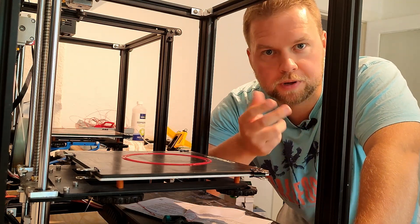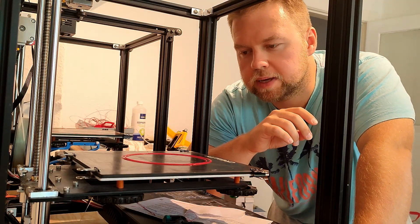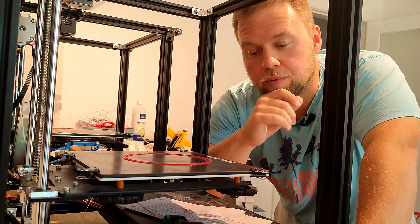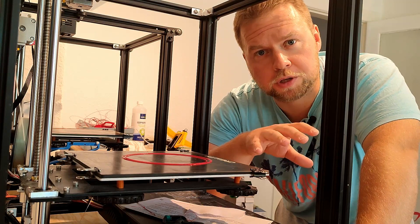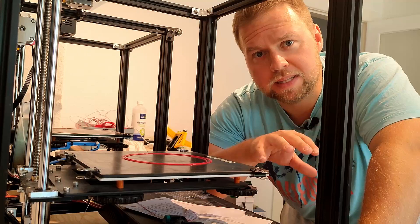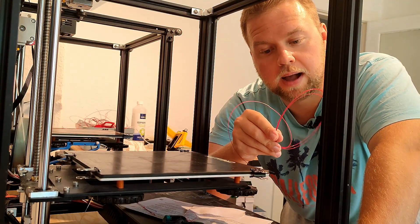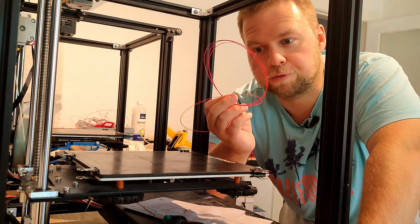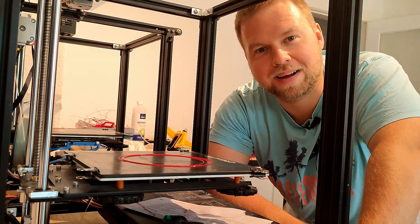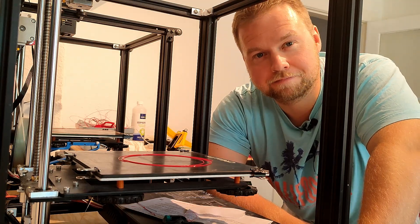Things were starting to look pretty bad. Four attempts failed, three of them on camera. The strands just kept ripping. So I did the one thing I usually regret doing — a bit of math and regression — and figured out that the strands were only able to take about 1.5 kilograms of force on average before breaking. Using that data, I created a new strand able to take about 3 kilograms of force, consisting of four lines from the printer nozzle, and started again with that material.